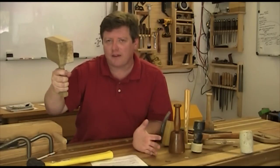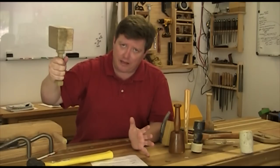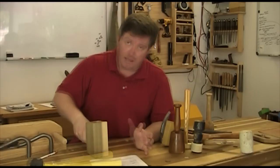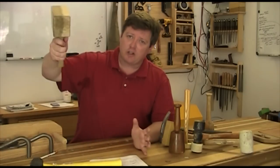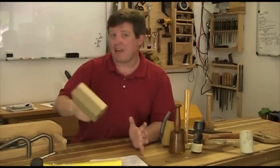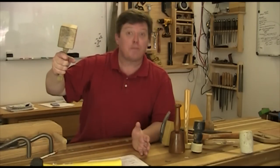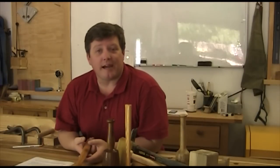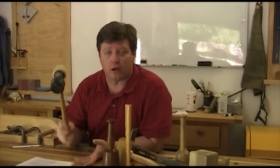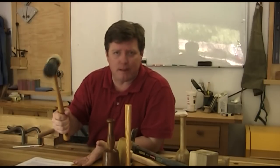In that analogy, gravity is a spring, and by lifting the mallet, we wound it up. The moment you release that mallet, all that potential energy is converted into kinetic energy, the energy of motion. And what's cool is we can leverage that energy going down with more energy from our muscles also going down. So we can, in theory, if we had the equal amount of energy to push down as we took to lift up, basically double our own power. And since power is additive, meaning for every inch it travels, I can make it go faster and faster and faster by both the gravity that's drawing it down quicker and my additive power of my muscles coming down.